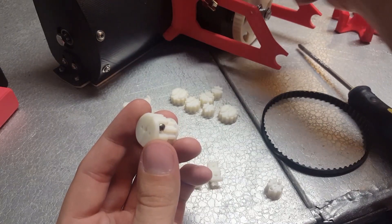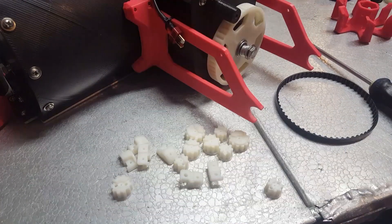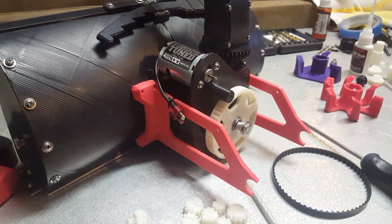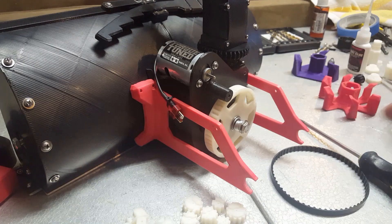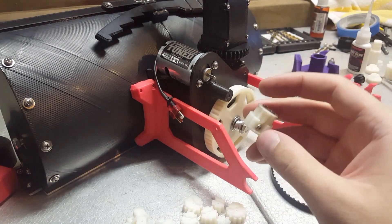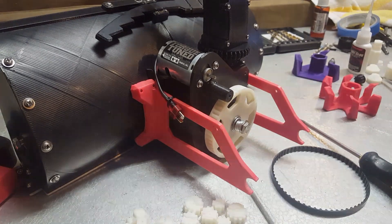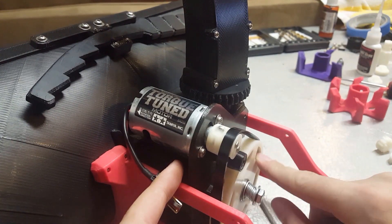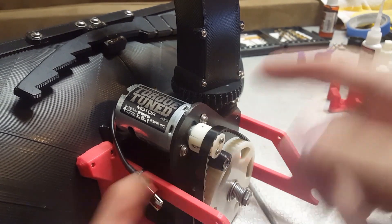You can see in the water video towards the end that the current pinions shipped with the kits would not work in the water — the pinion would just slip off and the motor shaft would just spin inside of the pinion, because moving water is a significant load on the motor. These pinions I already tested in the end of the video. They are significantly better than the stock ones. Here's the pinion installed — it's like a direct replacement for all the old pinions, but it's just a lot more accurate, smooth, and stronger.